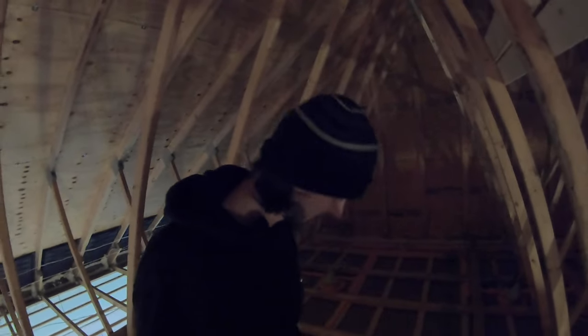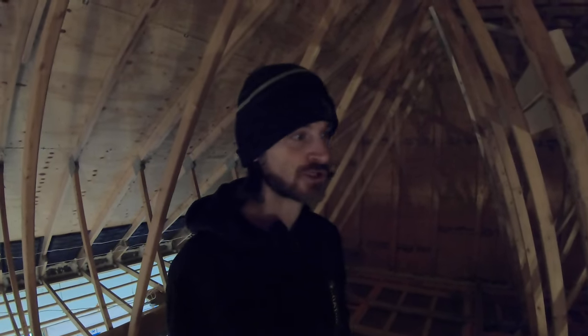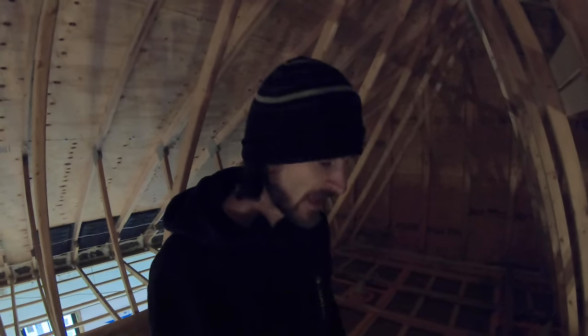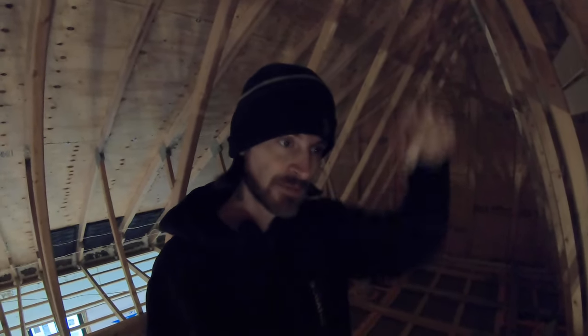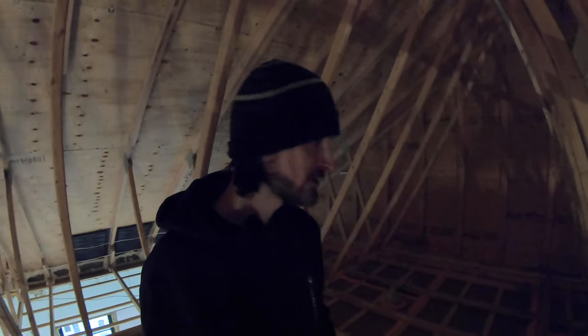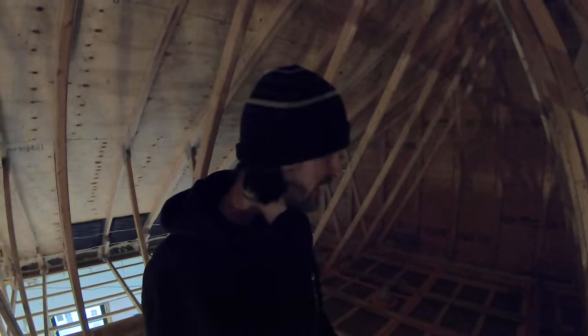The biggest thing, like I had mentioned, is making sure where any walls come together that the drywall is sealed to the top plate 2x4, and then any of the wires that come up as they go down into that cavity space, you want that 100% air sealed so air's not getting down into your cavity. And other than that, this should be good enough.